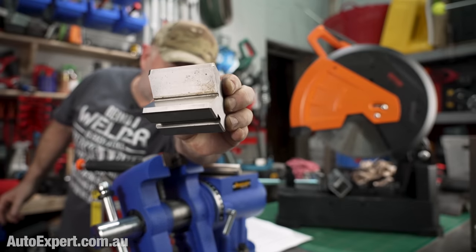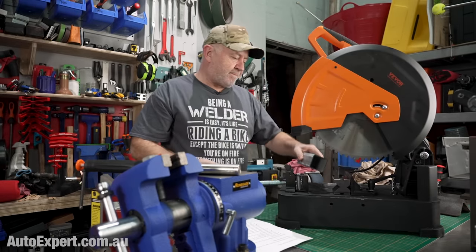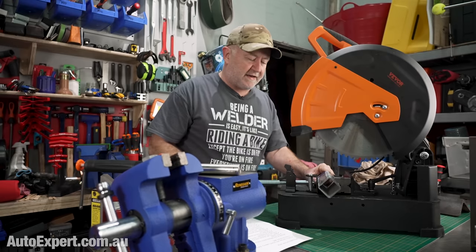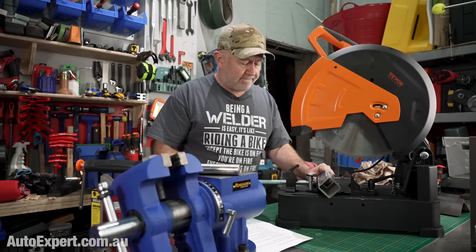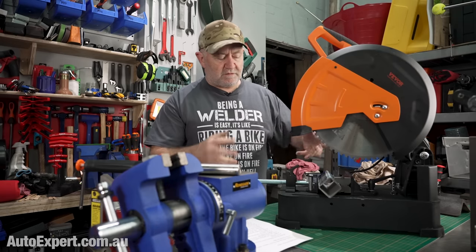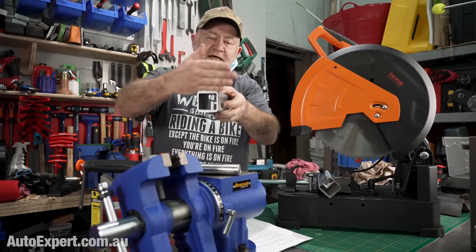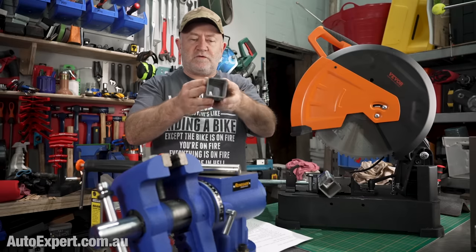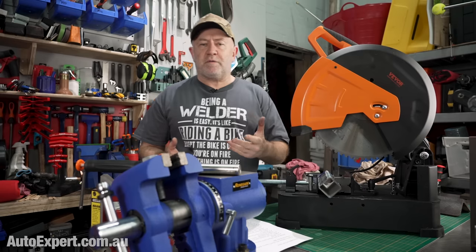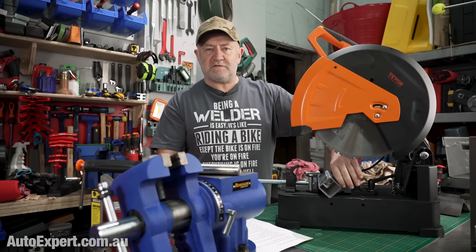Here's your basic machining V-block — you can place it in the setup and that allows you to safely clamp your tube on the diagonal. It'll take a little bit of rigging, but that's better from a tooth engagement point of view because you get the least drag. When the tube is flat, the saw blade works quite hard cutting the top and bottom surfaces. If you've got this V-block setup it takes that hard work out. The problem is if you're cutting mitres, you can't do it this way — you have to have the tube flat on the bed of the saw for mitres.